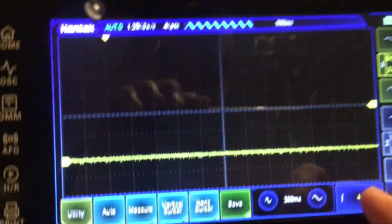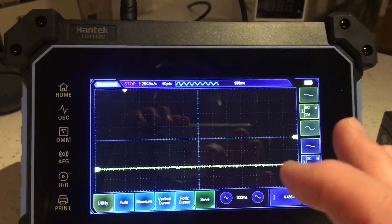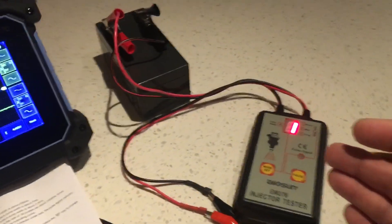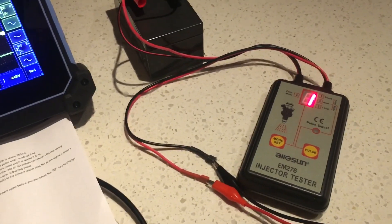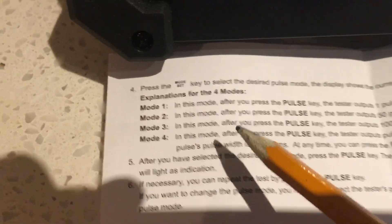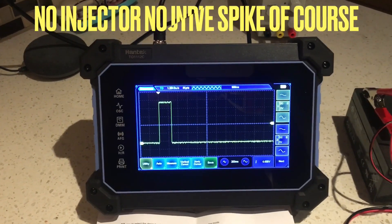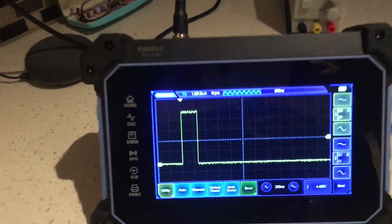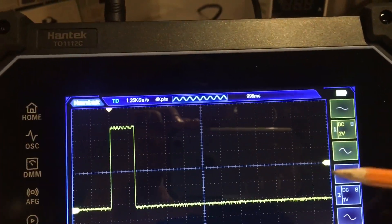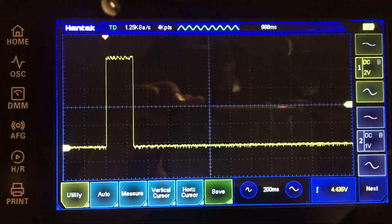I'm going to go into trigger here and select Normal mode, because I want it to hold the trace until we trigger it again. That will hold the measurement function detail for us so we can discuss it. The little rig will generate a single pulse or a number of pulses — the pulse width varies depending on what mode you're in, and all the modes are detailed in the manual. In Mode 1, a single pulse is generated. You can see it being held on the screen because we're in Normal trigger mode — it won't refresh until triggered. You can see my trigger levels both horizontally and vertically on the screen.